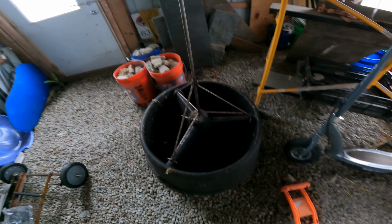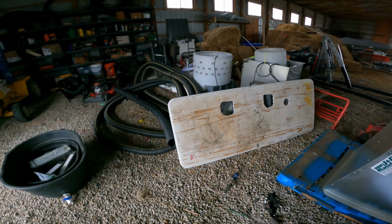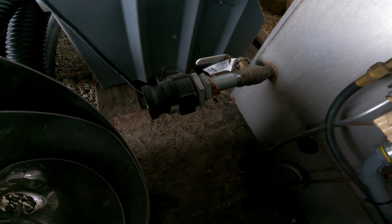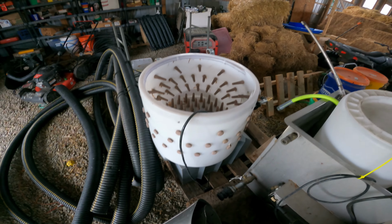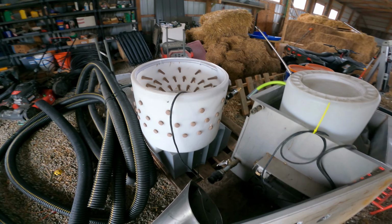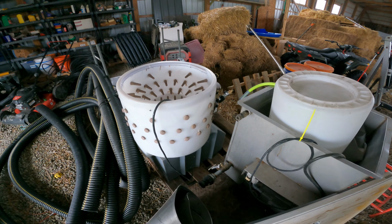And again, not bagging on Featherman. We have all their stuff. We have their scalder. I love the scalder. That thing's been a trooper for us. We got it configured the way I want it with our discharge pipe. It goes off to 2-inch. The plucker's doing well for us. I keep thinking I need to replace the fingers, but they keep telling me I'm only 3 or 4 years into that, and I should be getting another 3 or 4 years out of these fingers, so don't replace them.